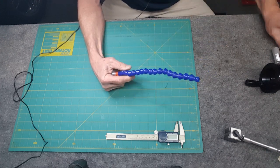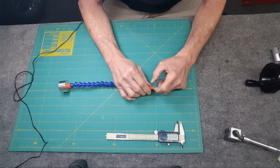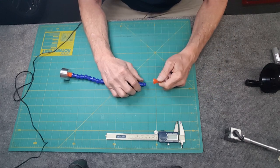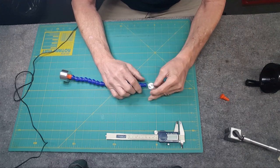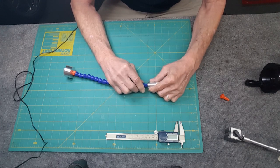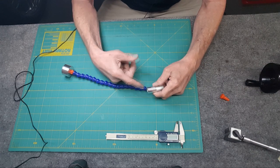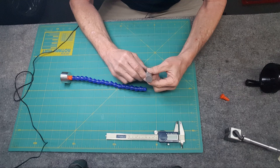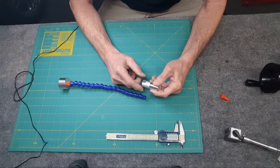And he did something, I don't know what he did with this tip. I couldn't even see what he did with the base, but I think he just kind of taped the big piece of plastic to this thing. So I wanted something a little more elite, kind of playing with this so far. Metric, it was a few thousandths under, so it fits nice and tight in there too. Push come to shove, I could put set screws if it eventually gets loose, so I don't want to put it in there yet. This, I was figuring just mill flats on it like that, put some set screws in there.